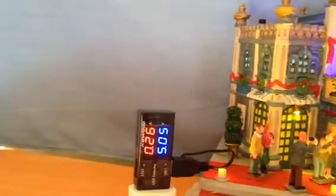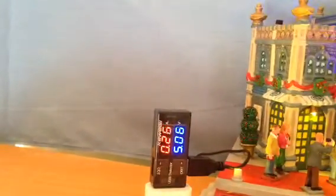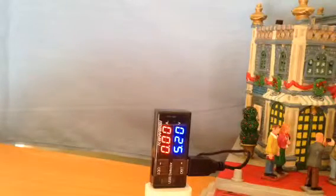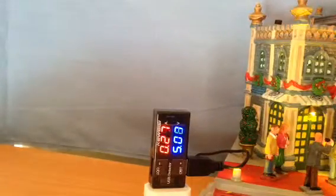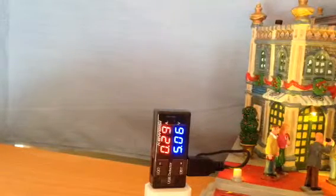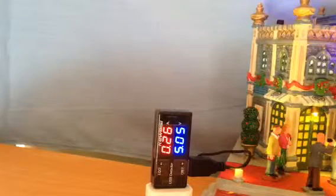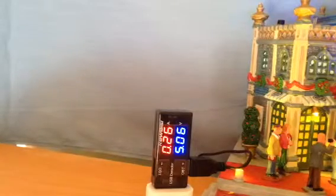But let's come back to our hero of the story. Here you've got the voltmeter in blue showing that it's gone down from 5.19 when it was off. See, so it's about 5.2 when it's off and 0 on the amperage. And let's turn this on — now you've got 5.06 volts and somewhere around 0.24, 0.27, 0.29, so roughly between 0.25 to 0.3 let's just say.